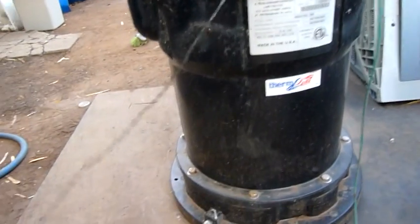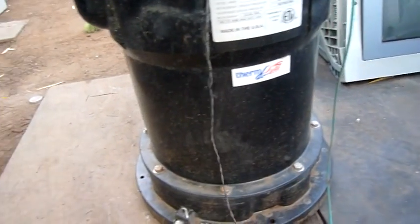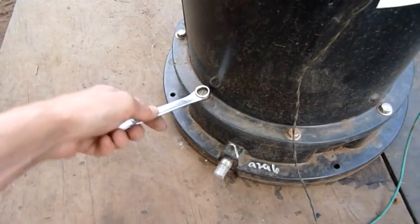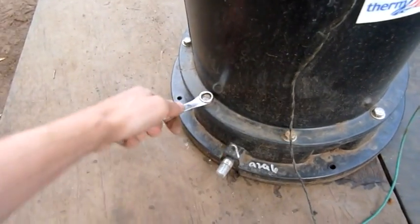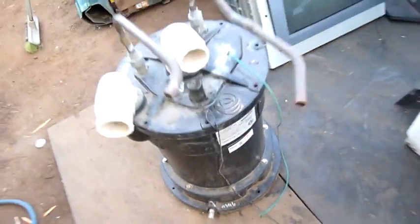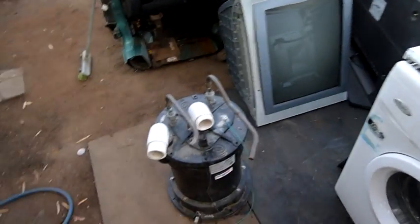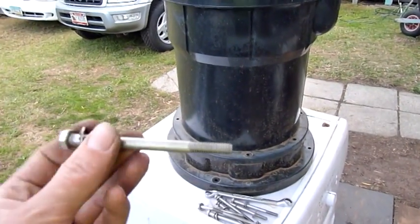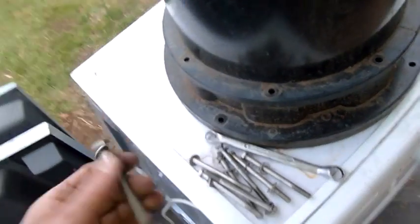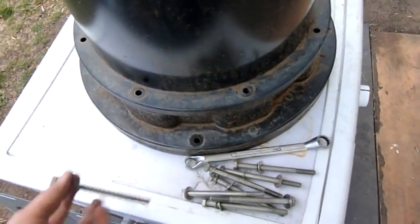Let's crack it open and have a look. I'm just going to tape these 13mm bolts out of the bottom — although knowing American stuff it's probably imperial, but I've got quite an assortment of spanners. Yeah, that's a metric 13mm so these are like 5/16 inch or something. It does work but only just — if they're any tighter this would just strip the head. These are 5/16 UNC bolts so you need a half-inch spanner for them, 12.7mm — that's why a 13mm is a little bit loose.